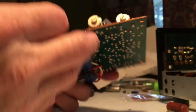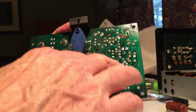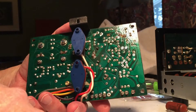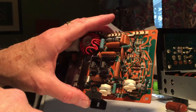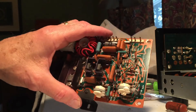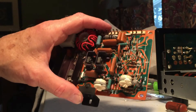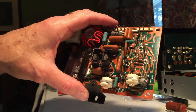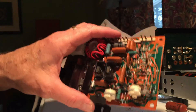Without hurting the board. At this point I'll take a little isopropyl alcohol with a Q-tip and clean those pads just to make sure there's not a lot of extra flux or anything on there, and it'll be ready to re-solder. So that's the use of the Hakko FR300 desoldering gun. I know a lot of people are very skilled with copper braid and with manual suction devices, but in my hands this is the way to go, so I highly recommend it.